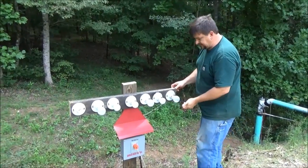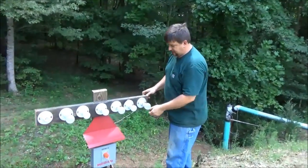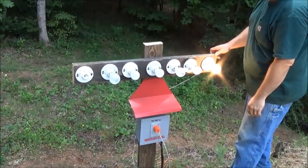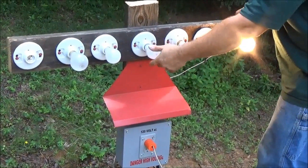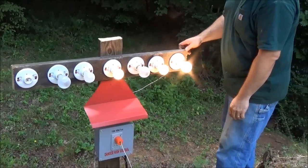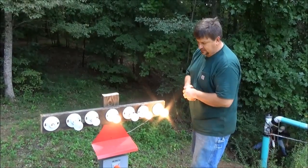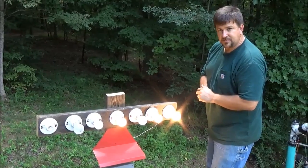We're doing a little load testing here. The pond is really low because I've been doing a lot of testing, so I've lost a two-foot head right there. These are 200-watt — that's a 200-watt light bulb — and these are 75-watt. I'm going to put 300, 350 watts on. I heard the turbine slow down. See if we can sustain that. My pond's dropped — I'm just setting up for testing. But there's a sustained 350 watts using the low head turbine out of the pond.